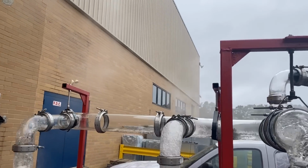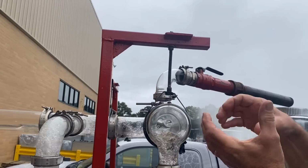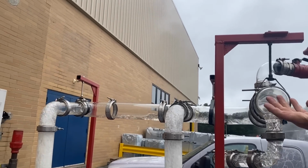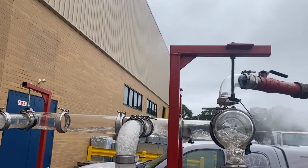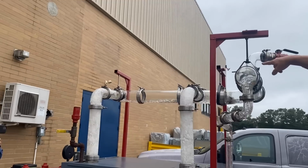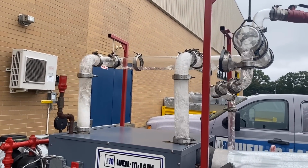I'm pretty sloppy right now in my header. I'm getting a lot of water. And remember, if you get water in the header, you're reducing the size. So I don't know if this is 4-inch pipe probably. Now I'm 3-inch pipe because I got 1 inch of water in my header. I just reduced it. So now I'm going to get more turbulent, more velocity. But I'm still pretty dry going up here. You see a little bit of condensate getting up in there. But I'm still pretty dry.